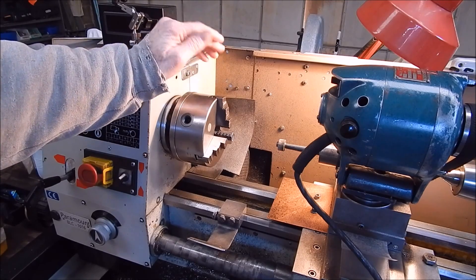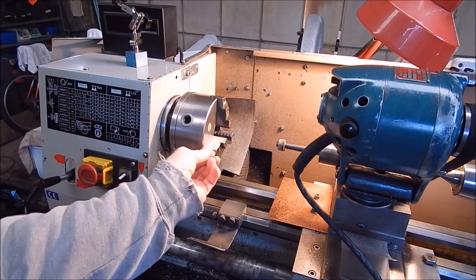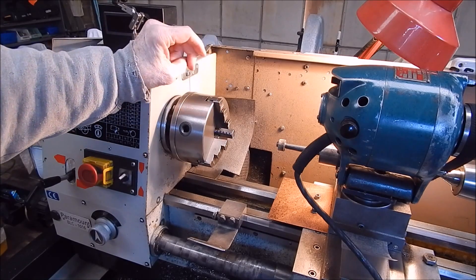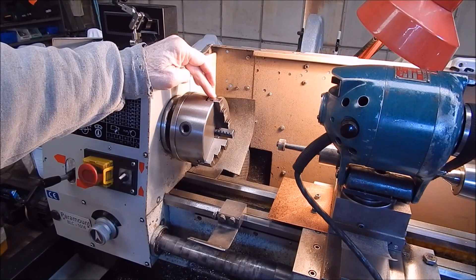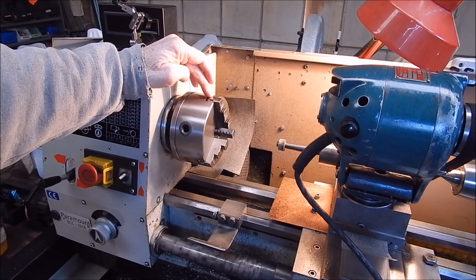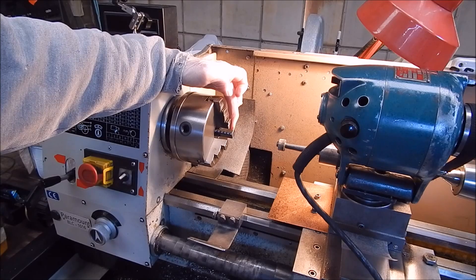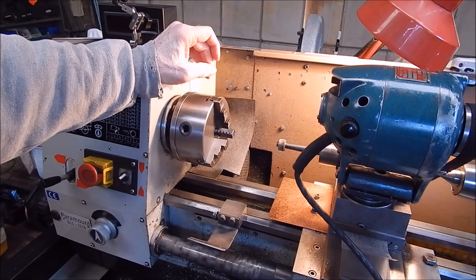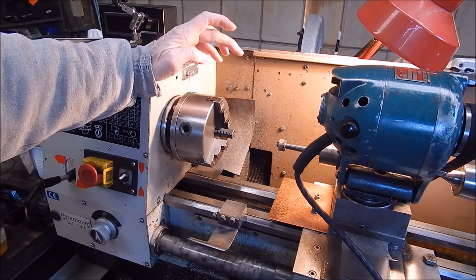So that wasn't going to work, but I still had to do these jaws. The jaws are a little bit loose — they've got enough play in them that they will pull back on their own. So I thought: I'll put the lathe on its highest speed, spin the chuck at full speed, and the inertia will throw the jaws back against the scroll plate. Theoretically it should throw them back hard against the scroll plate and load up the jaws evenly enough to do the job. So that's what I did.